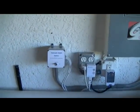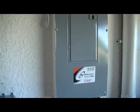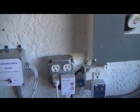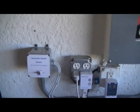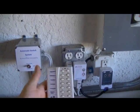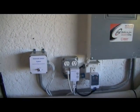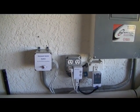What's really cool about this system is I can have any machine turn on the dust collector remotely because I used a current sensor in my panel. Now some people don't want to do that, and I understand because that's dangerous. If you're not familiar with electrical wiring and current sensors, I would not recommend going in that panel. However, you can set up the rest of the system and just use your remote switch at each machine — carry it around with you or have multiple remotes. I hope you like my system, I love it, it works really well. That's all for now, guys. Take care.